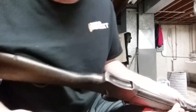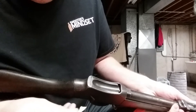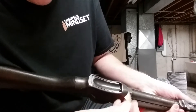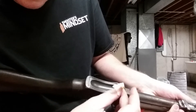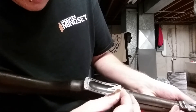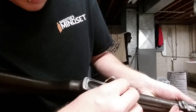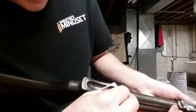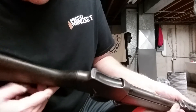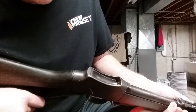And then we're gonna do an end play test, typically with just a piece of paper, which is about a thousandth and a half to two thousandths end play. This should not slip in between there. It does not — not even close. It's like hitting a brick wall. It's nice and tight. And you can actually feel when the end block rises rubbing on the case.